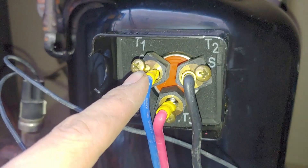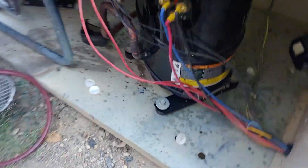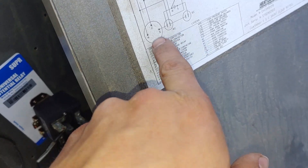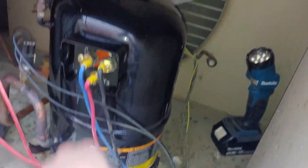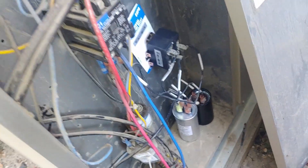So our terminal one is hooked up right here. It's kind of weird because the contactor is technically upside down, but terminal one is here with the blue, and that is where our five comes off for the relay. And then over here we have terminal two, which comes off of our run capacitor — which is correct if you look at our diagram there — and that is the S terminal. Our red down here goes up to terminal two, right here, where our run capacitor gets its other leg.